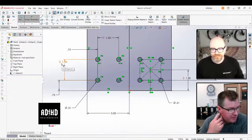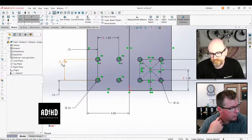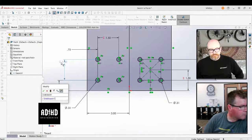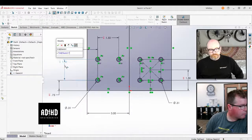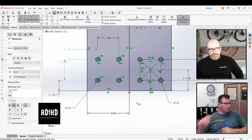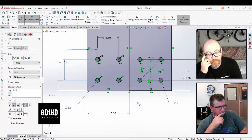I actually hate that feature. It annoys me that you then have to go in and move that first hole you placed in a not located place. To be honest, maybe another rule to discuss is when a hole is tapped, when a hole is countersunk, when a hole is something more complicated than just a hole, and has a dimension that's critical, it has to be done with the hole wizard. That saves sketches. That's true, and you can easily edit your holes. Yeah, that's probably the best part, actually.